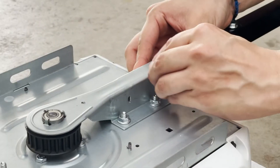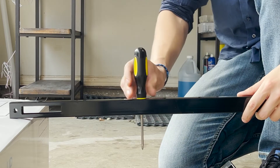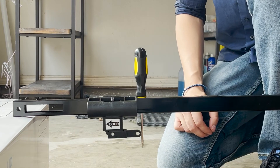Prop the end of the rail on the garage door opener carton and attach the rail to the motor head. Insert the clevis pin followed by the hitch pin to secure the clevis pin. Insert a Phillips screwdriver into the hole near the slot end. Slide the trolley onto the rail, making sure the arrow on the trolley points toward the door.